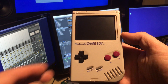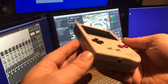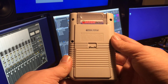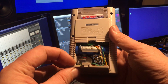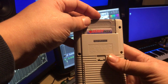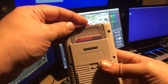So here's the finished Berry Boy. This is the micro USB jack for charging the battery inside. Here is a USB port for plugging in memory sticks, keyboards, and mice, and the cartridge is blanked out. The battery cover is still openable — I modified it slightly so there are two USB ports in there. One's got Wi-Fi in it, and there's the amplifier, the charging distribution circuit, and the battery. You've also got access to the memory card at the top via the blanked-out cartridge.